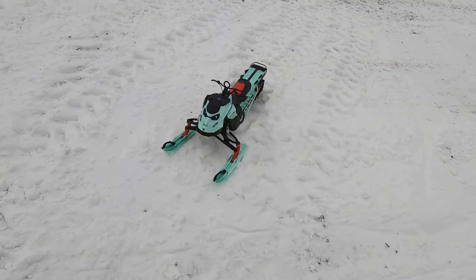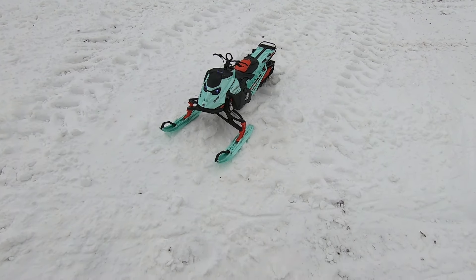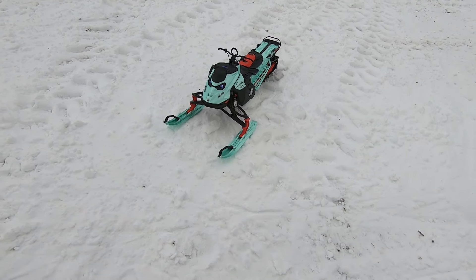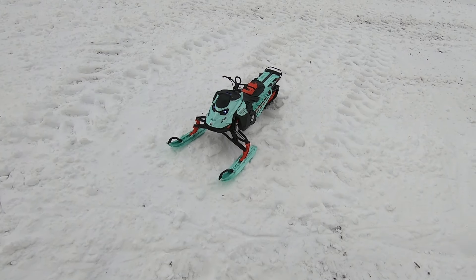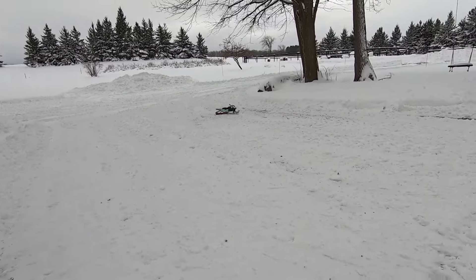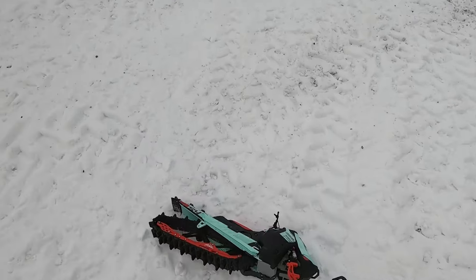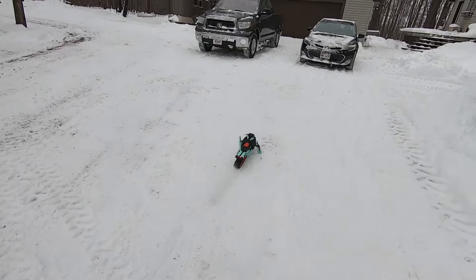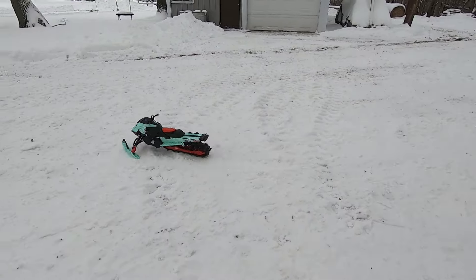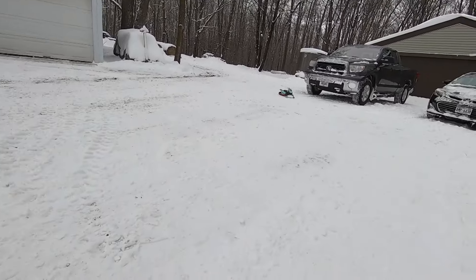Here's my 2024 free ride, and I've taken a slightly different approach trying to work out the issue of it tipping over so easily. I've modified Build It Better's plus 20mm wide front suspension arms to plus 30. Let's see how this does in comparison. It's not great at all — it'll turn slowly like this, and that's what you see everybody doing, just making slow turns. It seems like a straight-line machine.